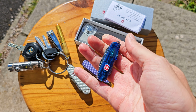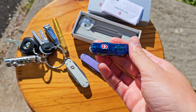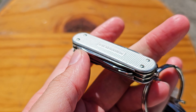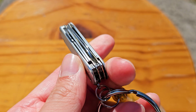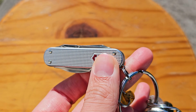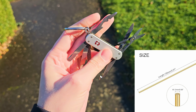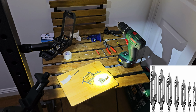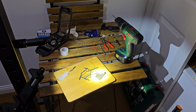As a welcome backup, I bought another Midnight Manager which was luckily on offer, just in case my project fails. I concluded that the best course of action was to modify my Alox Mini Champ since it already had all the tools to make the Alox Rambler. Furthermore, I will be removing tools, which means that I can reuse the stock brass rods. But if you want to buy them separately, they are 1.5mm thick and I will link them below in the description. As for tools, you will need a drill, ideally with a 1.5mm center metal drill bit, but I used the standard 2mm one since that's what I had.